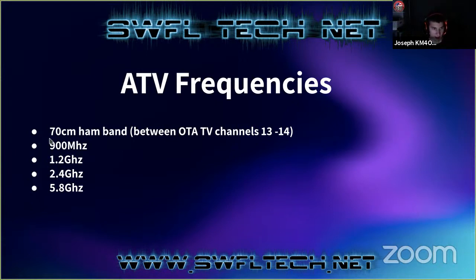So 70 centimeter has the benefit of being a lower frequency, so it'll actually penetrate stuff better. That's the only real benefit. The major downside is antenna size, and this is going to become relevant later when I get into what amateur television is most widely used for in present times. So 900 megahertz penetrates not as good as 70 centimeter, but it does do it compared to the highest one,